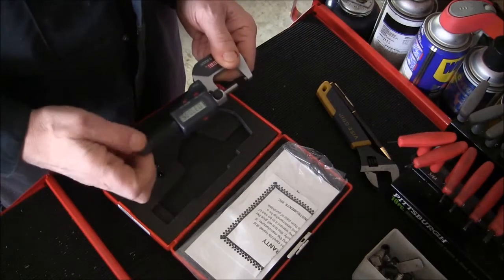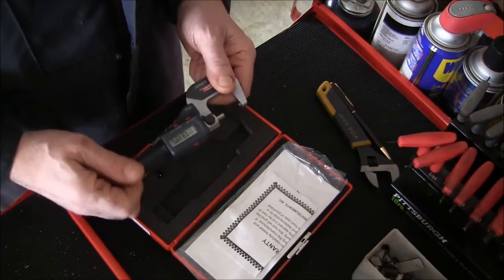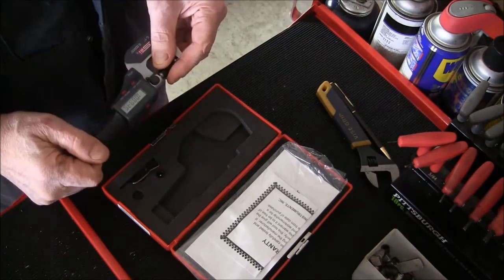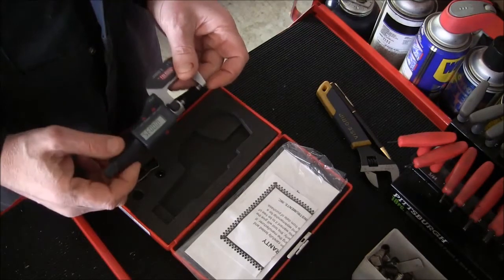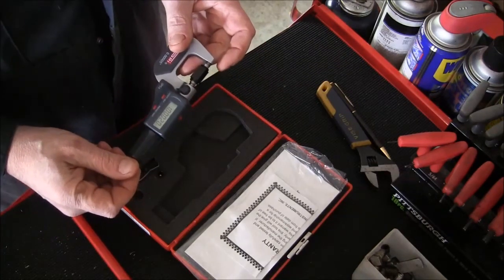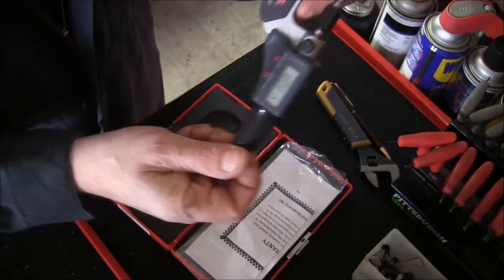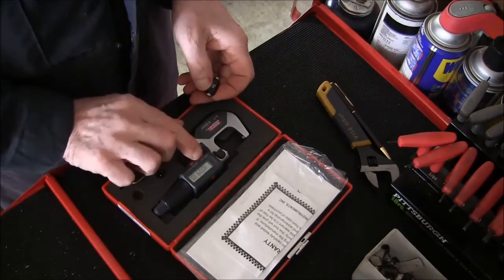Let's see how close she is. It's a little dark still in the shop because even though it's 55 out the fluorescent lights have not cooperated. Okay, so here we are in absolute mode — two ten-thousandths. Could be the cold; I think these standards are calibrated for around 70 degrees. So we're pretty happy with that.